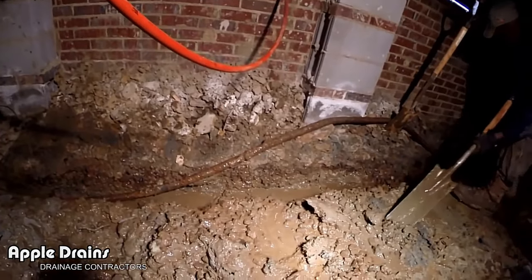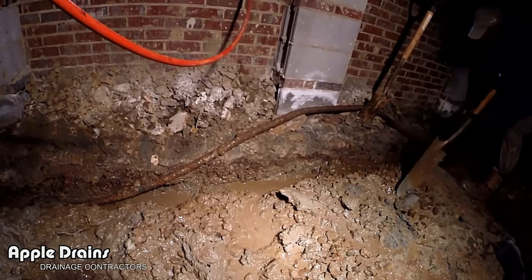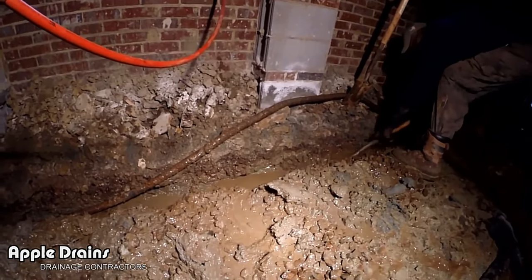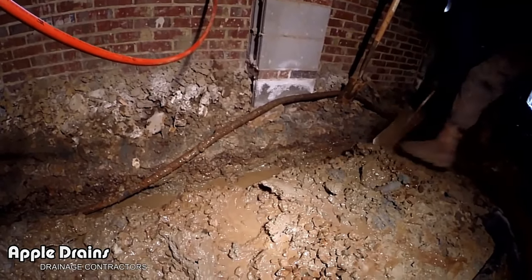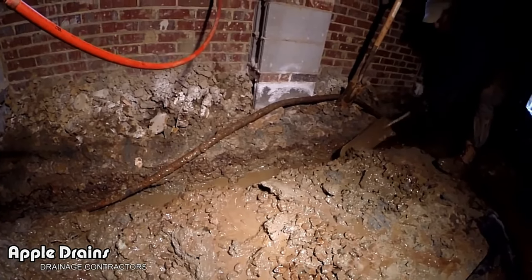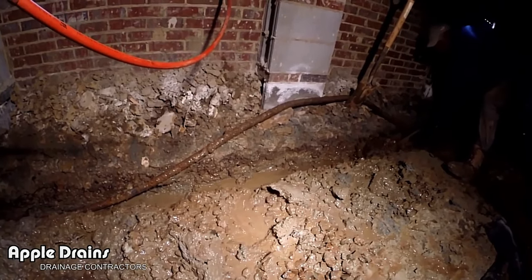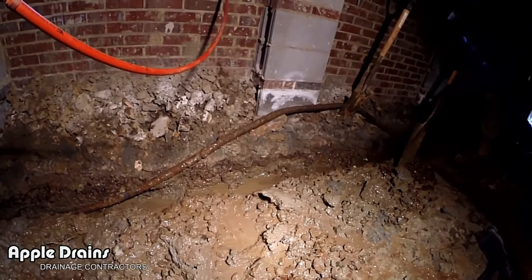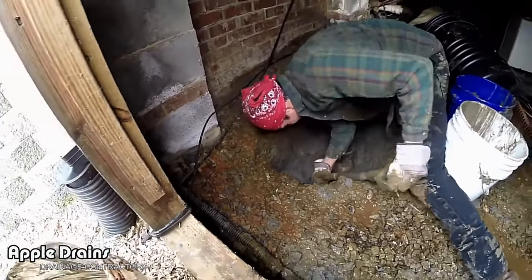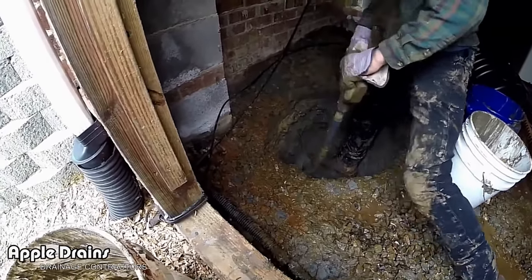You can see them digging out the old trench. The gravel makes it a little tougher to get out — it's wet and stops the shovel from going down — but it moves right along. We just need to get below that footer and then we'll put new gravel and new pipe in here. This system should rework itself and drain away quite well. Paul's moving right along, just about deep enough to put the pit in.